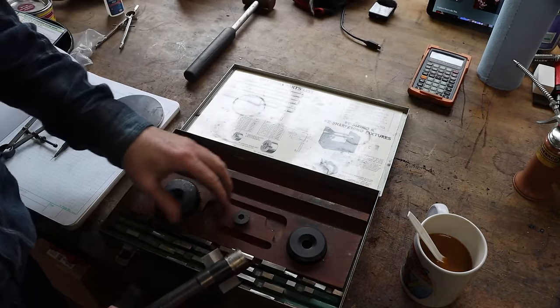So I got my flange almost done, but I need to drill a larger hole in the center there, and I'll show you what it's for in just a second. Got these holes drilled and tapped. That is a pretty nice looking hole for the way that it drilled. So I'm gonna bolt this on here, and then we'll get set up in the drill press, and we will punch a hole in this, and then we'll make the other part of this thing.